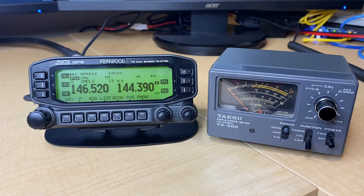What is SWR? SWR is sometimes called VSWR and stands for voltage standing wave ratio. In the typical ham shack, a radio or transmitter is connected to a feed line or coax, which is then connected to the antenna. When you key up your radio and you're transmitting, it develops a radio frequency voltage that goes down the transmission line to the antenna — this is called the forward wave. Think of the forward wave as the energy or power from your radio that goes to your antenna that your antenna radiates. If your antenna or coax has a problem, this transfer of power will not happen the way it needs to, and that can lead to what's called a reflective wave coming back towards the radio the opposite direction down your coax. The relationship between forward and reflected power is what SWR measures.